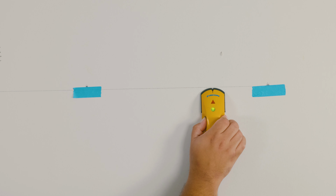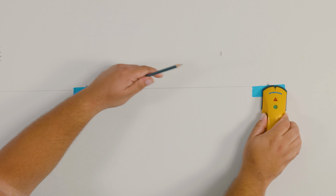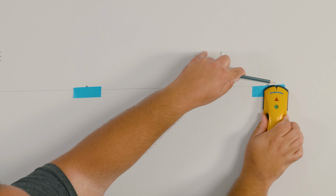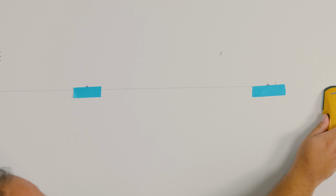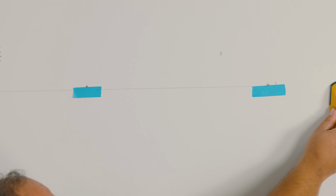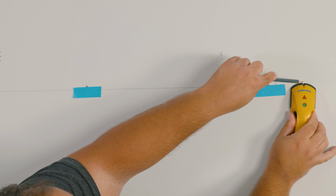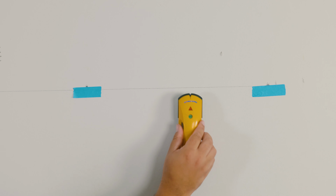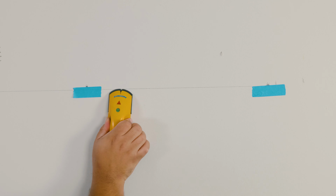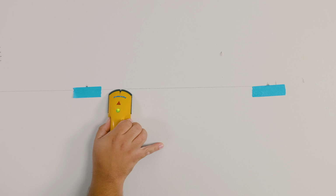So we're gonna take our stud finder and starting on a green position on this particular, meaning there's no stud behind the wall, we start moving it until we get a beep or a red signal. We double confirm this information and make our first mark. And remember, you can do this with a pencil or tape. So that means we found one of the edges of the stud. Now we have to go on the other side to find the other edge. We have a full video on how to use a stud finder. We'll leave a link in the description of the video.